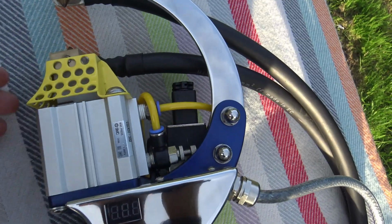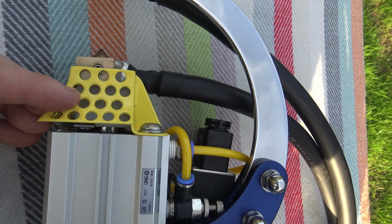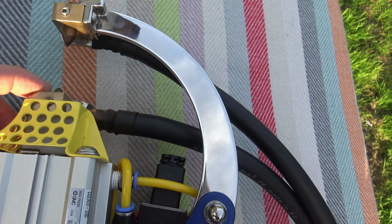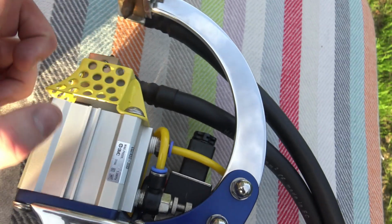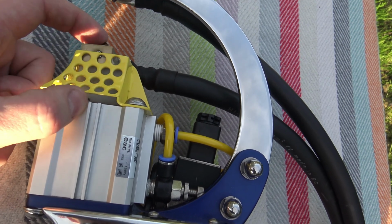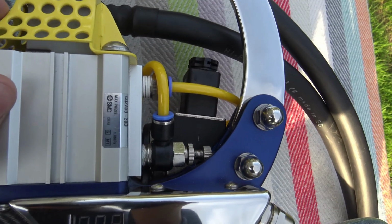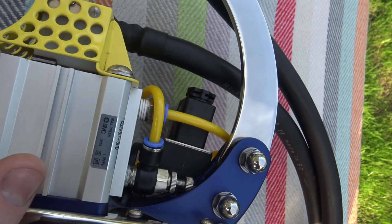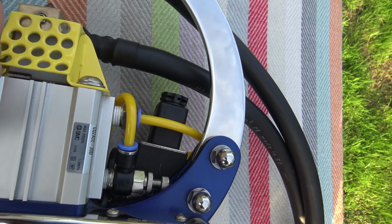I couldn't get it out, so I forgot to say too, there's an insulator block in here, and there's a fiberglass copper plate between that and the brass block. The brass block end is held by 2 stainless steel bolts. So if you were to put a multimeter between the body of this and this lower brass block, there'd be no continuity between them because there's an insulator in here. On the bolts there's a metal washer between the nylon block that supports the pressure that the block is squeezed to the nylon, if that makes sense.